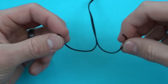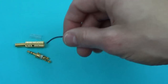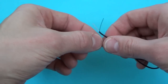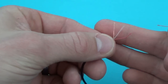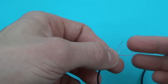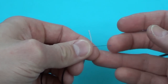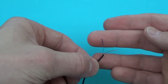That way you have the two wires — one would be your right and one would be your left. Next you're going to have to strip away the black coating from the wire on both of these, so I'm going to do that with the wire stripper. I would remove about maybe a half inch or so. Now I got the wire stripped — the black wire cover stripped away to expose the internal wires. You're going to notice one has a red colored wire and a copper colored wire. There might be some white fuzzy thread-like material — that's just insulation, don't worry about that, you can just cut that off. The other side will have a copper wire as well and a blue or green colored wire. So the right earphone has the red wire, and the left earphone has the green or blue wire.